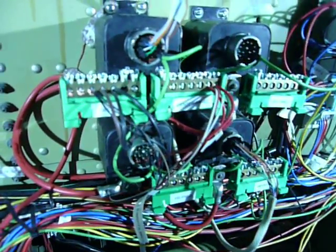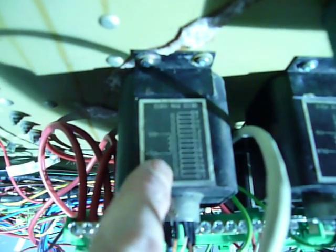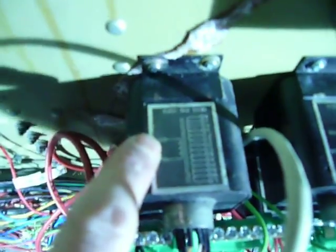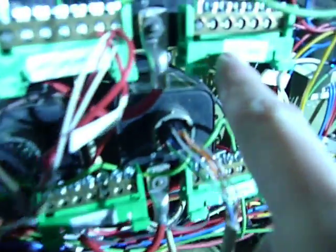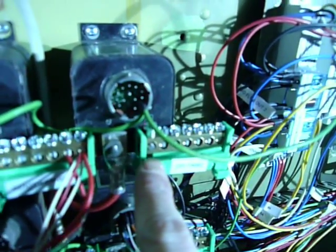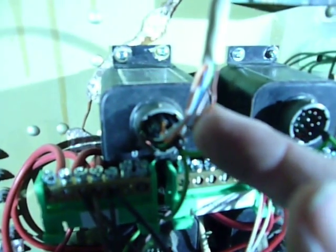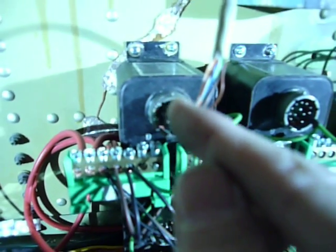These are from the captain's side console, just next to the left feet. The working principle is simple — here is the schematics, I don't know if that is visible or not. It's just a transformer that has a lot of primary inputs and one secondary output. There is a bus mounted on one of the outputs and the second output goes to ground which is then common. By changing the 115V input to different primary inputs of the transformer, it changes the voltage on the secondary.